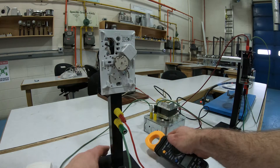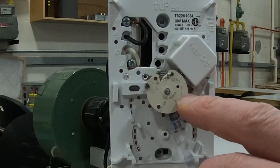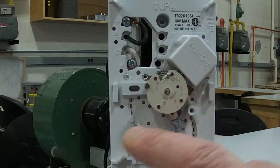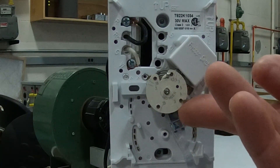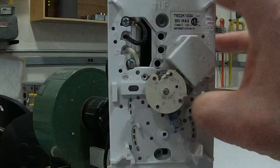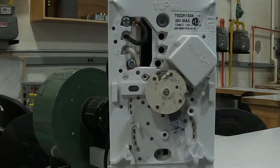Now I can turn that off. So we have 0.4, which is that line right there — I can see it. I can move the dial to make the furnace turn off and on. Right there. Guess what? You have just set your heat anticipator. This is used for furnace systems. It is not used for hot water heating, especially for slab heat — we do not need heat anticipators for slab heat.